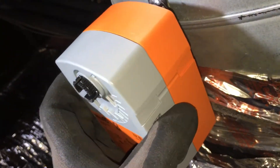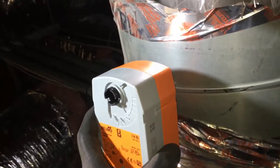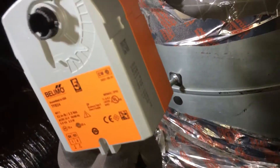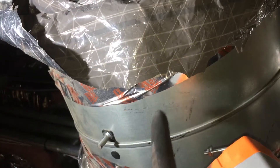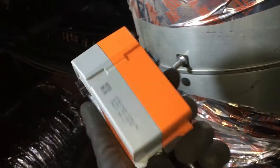It's going to be iffy — we'll see, we're going to find out. It definitely doesn't fit right now; it's close. But we're going to try it and see if this works, because I'm just tired of the residential stuff being used in commercial and industrial applications. So let's see how this goes, because I don't want to be called back out here for these things constantly going out — I need something a little more reliable. Belimo is the way to go, but I've just never retrofitted a Honeywell damper with a Belimo before. This is my first retrofit and we're going to find out.